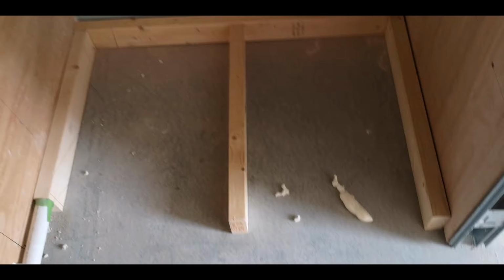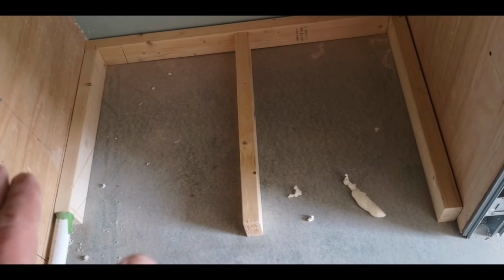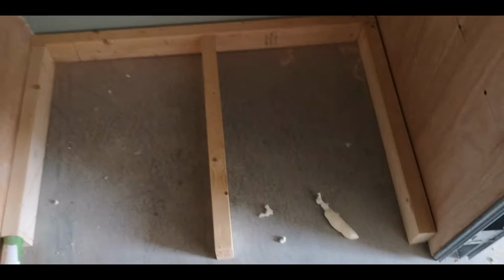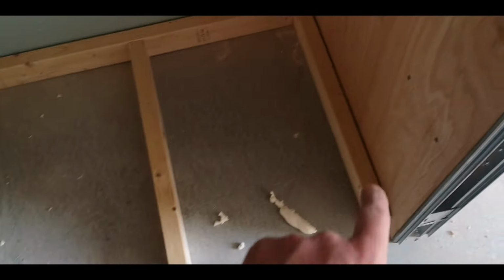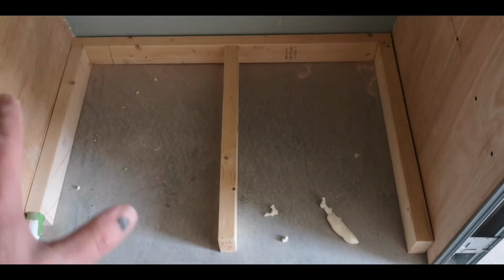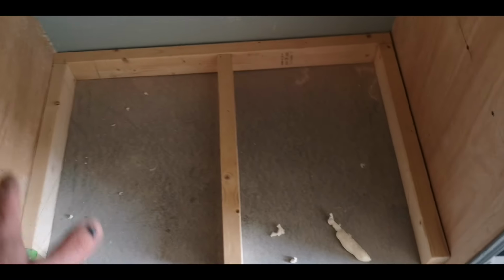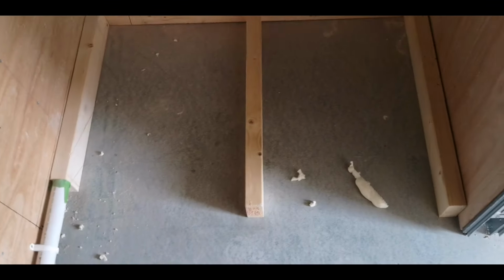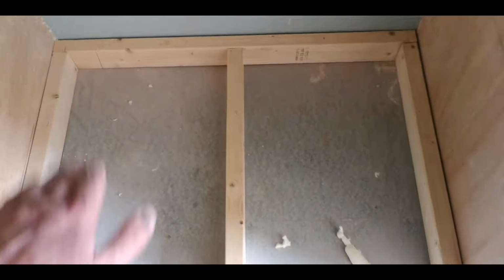This one might say, well, you need tile adhesive between the tray and the OSB, flexible adhesive. Well, otherwise it'll crack. This is my answer to that. If you look at the tray underneath, you'll see it's got 1, 2, 3, 4, 6 screw holes in the bottom of it for a leg kit. So essentially, if you want to get a leg kit for the shower, you get a leg there, a leg there, a leg there, a leg there, a leg there, and a leg there, with no support in between. So just work that one out for yourself. So the 18mm ply, the supports I have in there, and the foam to fill the gap probably isn't needed, but it sticks it in place and stops it moving, so it works.